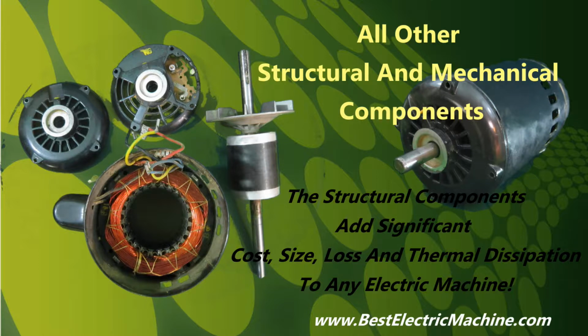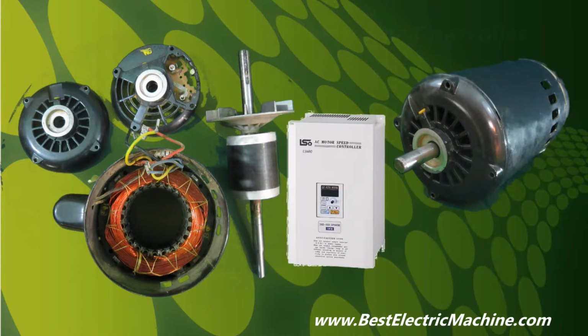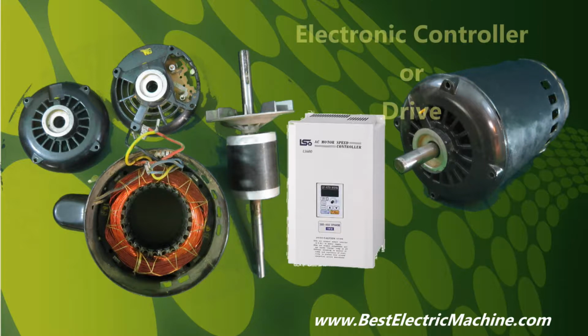As a fifth and increasingly critical component of any electric machine system, electronic control of the current, voltage, and excitation frequency of the active winding set is now commonly used to at least implement practical operation of the electric machine, such as for the permanent magnet, reluctance, or doubly-fed electric machine, or to tune the performance of any electric machine between the dynamics of the application and the electrical environment.